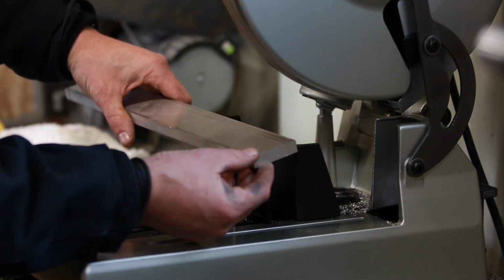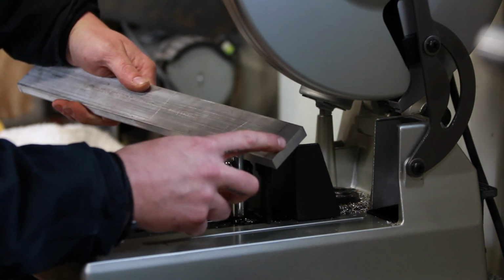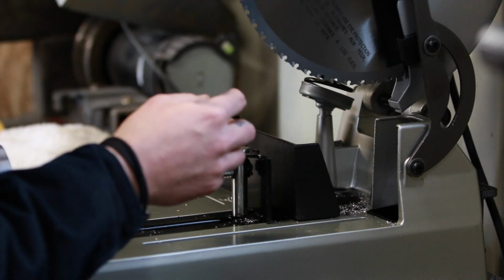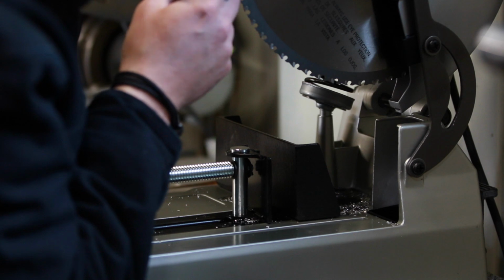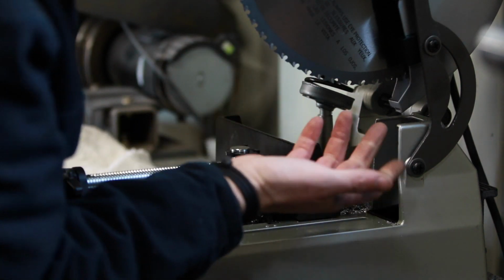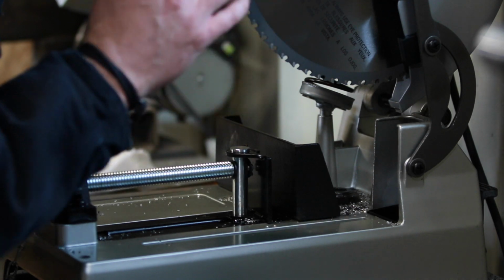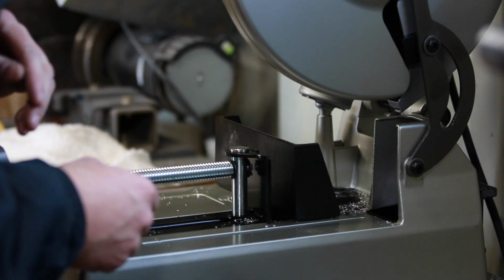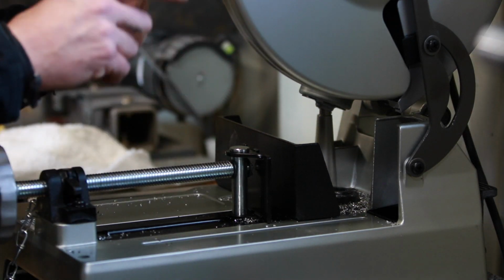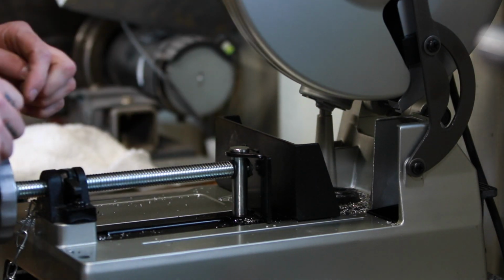I cut that fine. It actually leaves a bit more of a burr than it does with steel. Let's see if we have any loading. And you can see there's still some of the aluminum stuck in the teeth, and I think that might be the reason why they would say it voids the warranty, but wow, that's amazing. This tool is really, really cool.